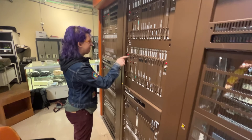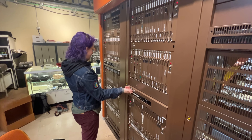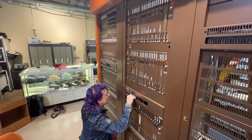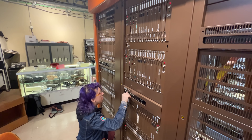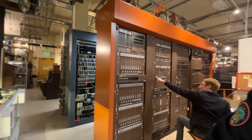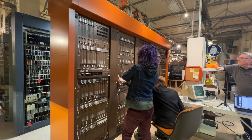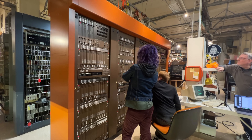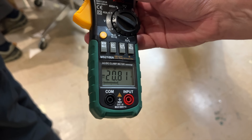Everything is showing a fail state initially. Now that all the breakers are on, the DMS-10 can start to boot. This is a really lengthy process — it was only meant to be performed once and they didn't exactly optimize for a fast boot-up sequence. So there's a lot of waiting. A few minutes later we're drawing 20.81 amps and nothing's visibly on yet, but the fans are running.